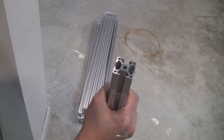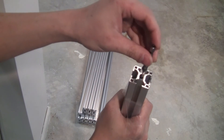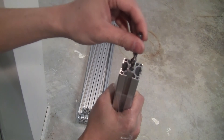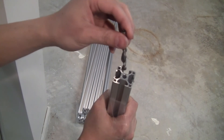This is one of the new bars without the thread, and the tip of the tap just fits exactly inside this hole, so you don't need to drill it — you only need to run the tap to make the thread. Let me show you how I make the thread here with the drill.